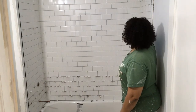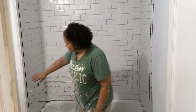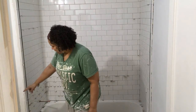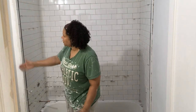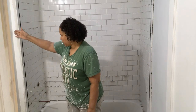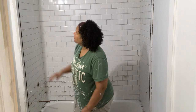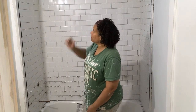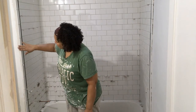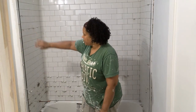I will be mounting a shelf onto this wall, and the portion where it'll be mounted is level enough that it will work. The other weird issue was this wall — making the border go up straight meant it extended beyond the wall, which is not straight. So I ended up reinforcing this with some mortar so it'll be nice and strong for when we put the shower rod in or if anyone leans on it. I'll fill this all in with compound and it'll basically form a new little wall right there.